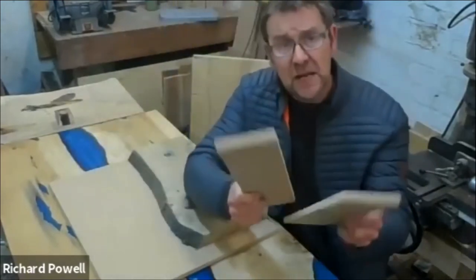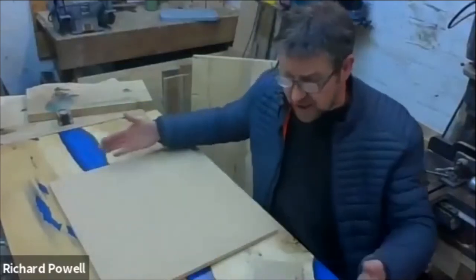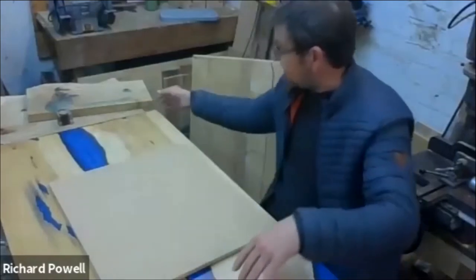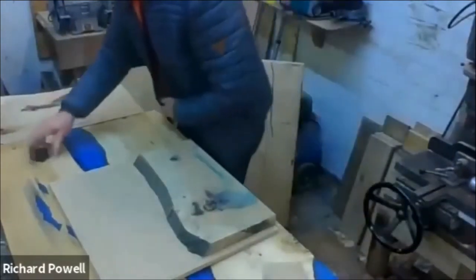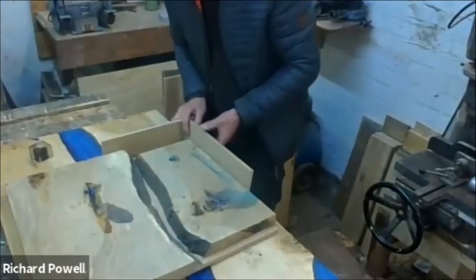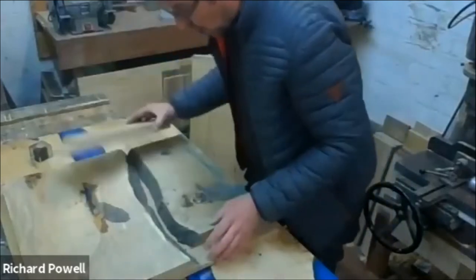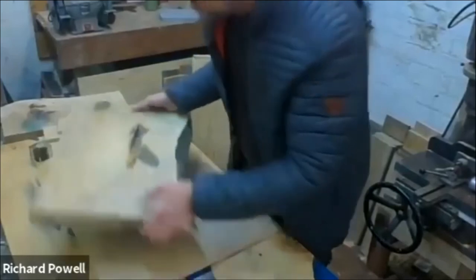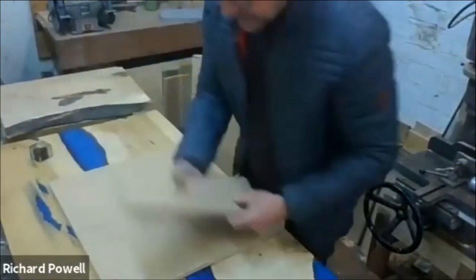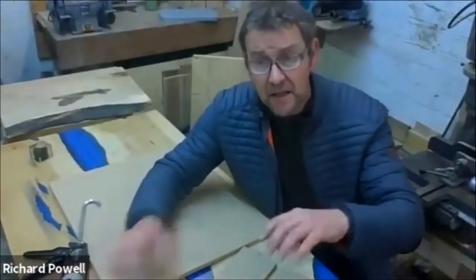You have to make this essentially watertight. When you're making your tray up — you've sourced your timber, put it together, measured it, cut your tray to suit — you've got your two bits without any resin, setting them into the tray with sides on. Then you pour the resin down the center. It's really critical to get it absolutely watertight. The way we do that is with silicone, because it peels off the resin really easily.